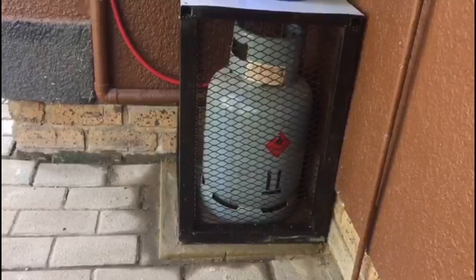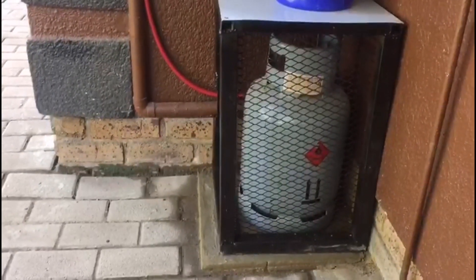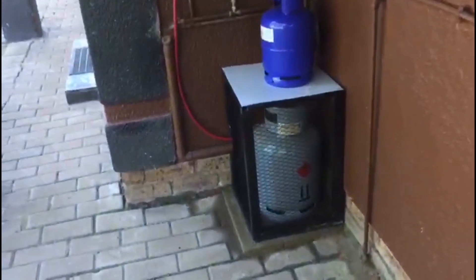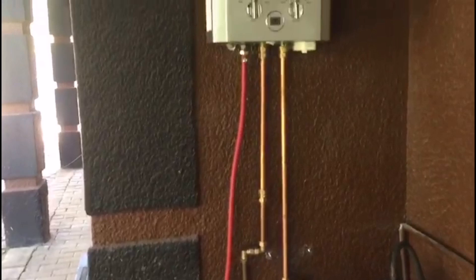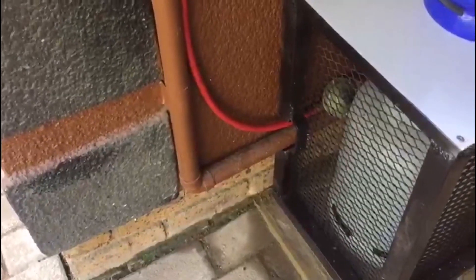So now we've done the bottom with the cement, the frame is on, and the bottle is inside - everything looks wonderful. This is for the shower. At the moment we've got another bottle on top here that needs to move, along with this whole pipe - that one goes to the house stove, so it's all gonna move around to the other side of the fence where the pipe goes into the house. We've got a tiny bottle in just to give us gas for now, but normally it's a 9 or a 19kg bottle. The gas line goes up to the heater - it's gotta be plumbed properly, just loose now, but I've made a provision where it can go through the other drain pipe.